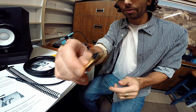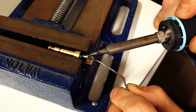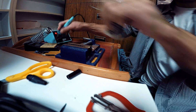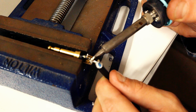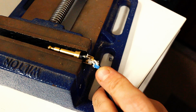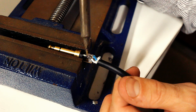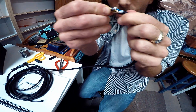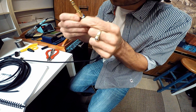Now it's time to get it onto the connector. We're going to go blue, white, silver. Let's get it in the vise grip. What I like to do is melt a little bit of solder onto the connector first — this way it has a little something to stick to and makes the process a bit easier. I'm going to start with the ground, get it in as deep as we can, and make sure it's flattened in there so it's not touching any of the other connectors. Now the white, and then the blue. We just need to double check that there's no chance these wires are going to touch, so I'll use my pointy tool to separate them a little bit.